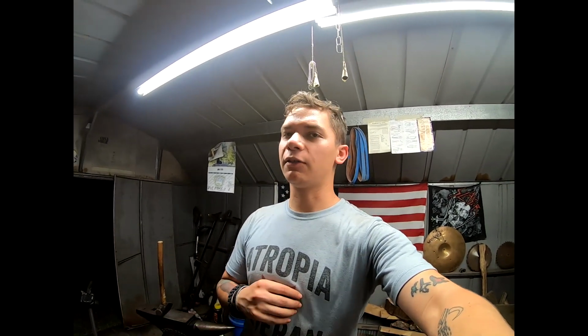So tempering is putting it in an oven and just letting it soak up the heat. I would say 430, 445 for about an hour, and you do that twice. So you let it come back up to room temperature, and then you throw it back in there. It really just softens up the metal just soft enough where it's still flexible, but it won't break.